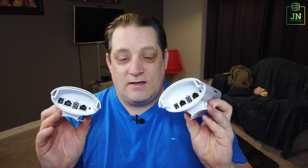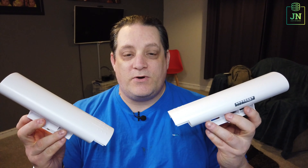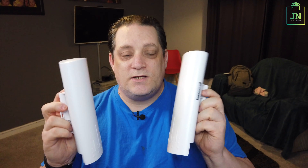So to summarise the specs: 300 megabit speed, 5.8 GHz, maximum range 3 kilometres in open space. It covers a lot of standard stuff which we'll go through in the second video during the software setup. It's 24 volts POE power supply, easily installed and deployed. And for £70 from Amazon, it's not bad for a cheap solution. If it works well, we'll put it to the test — the person in the shed will be using Netflix, web surfing, and YouTube, so we'll see how robust these are for £70.